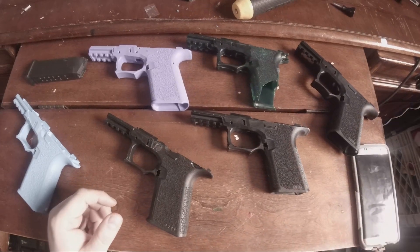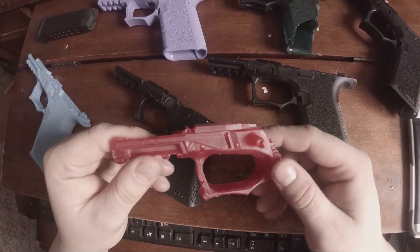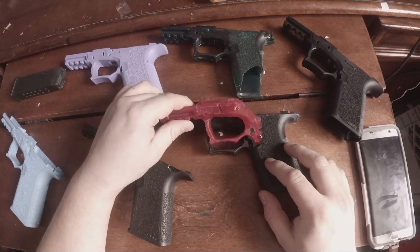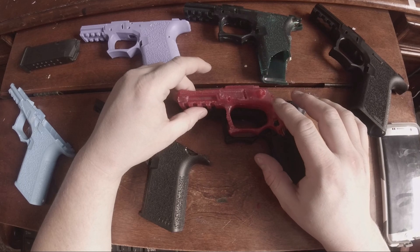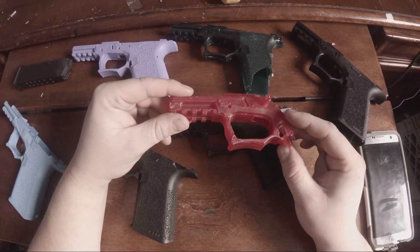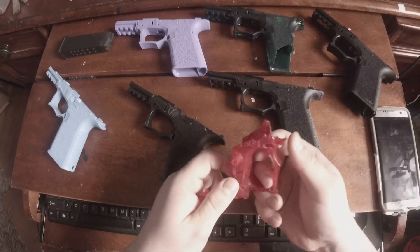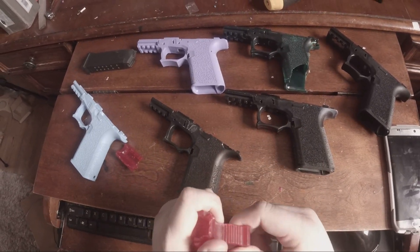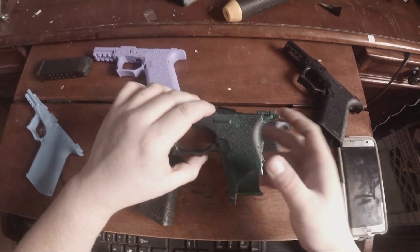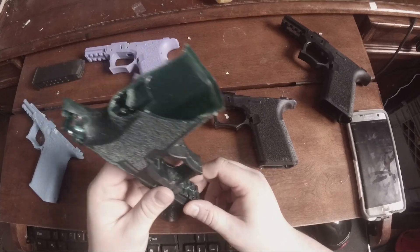Although that color was really nice - it's like a lava red, it's see-through. As you can tell, I molded this one downward and it didn't fill back here. This is one of the first ones I poured directly down, had to tilt it, and it still didn't fill up back here properly. Of course this is junk - it's still strong in certain places, not there obviously. Trigger guard is pretty strong. I did the same with this translucent green - when I poured it, it dripped out the front because I didn't secure it all the way.